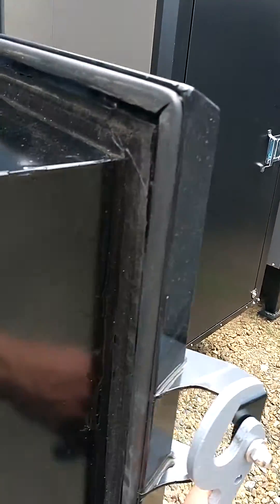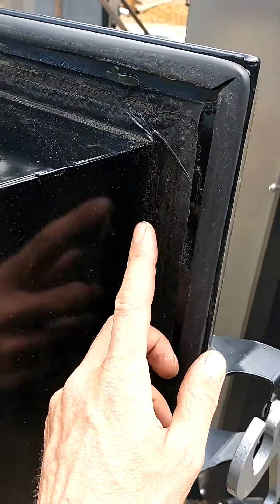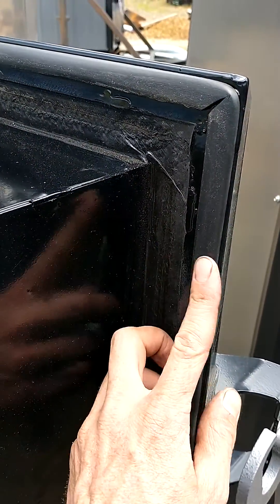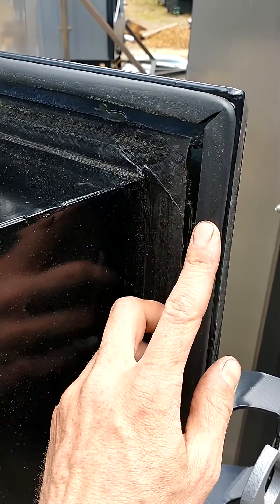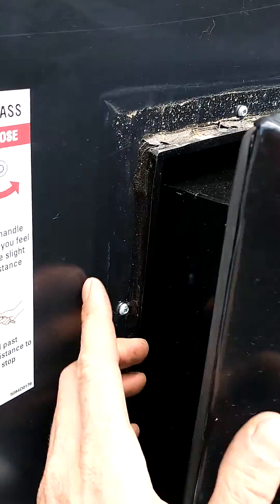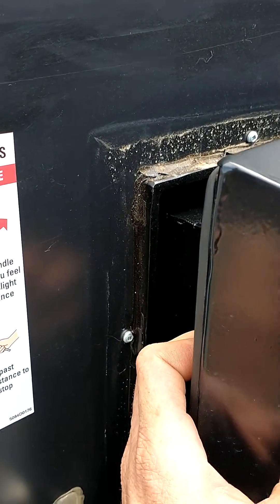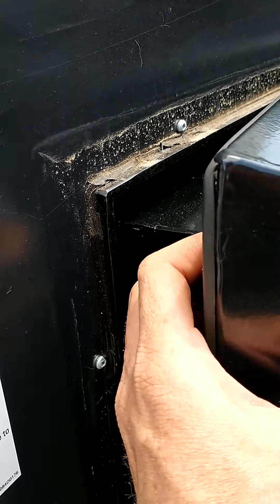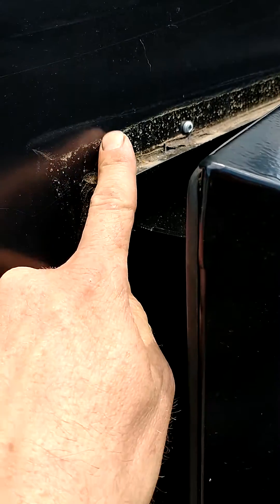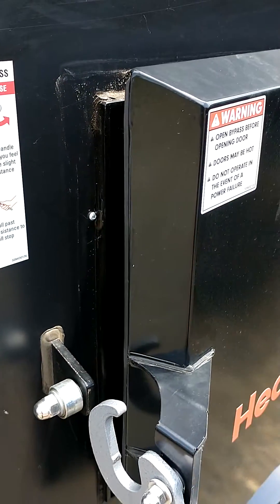Also, one of the changes on the inside — originally it was just this high temp silicone gasket with the rope behind it. They've widened the door and insulated it, filled it with foam, and then added another gasket. So it's a double gasket, and when that closes, the door jamb here hits the gasket — that's what seals from the heat of the fire and the suction of the fan. That did the job the old gasket did, but with this additional gasket, it hits the front sheet metal here. So that hot door jamb is not out in the elements at all anymore, minimizing heat loss.